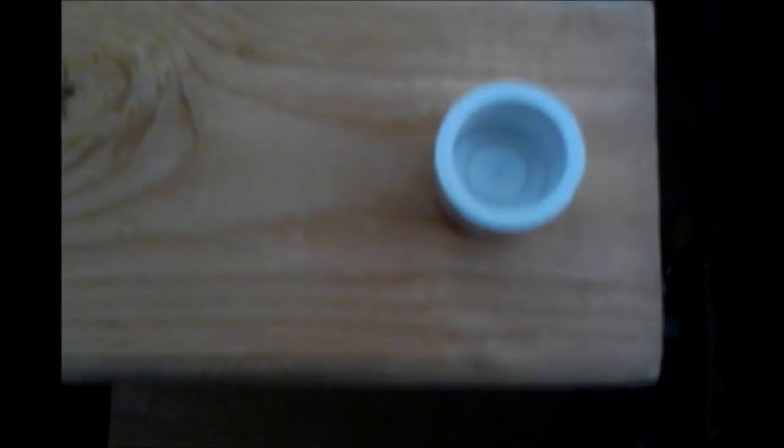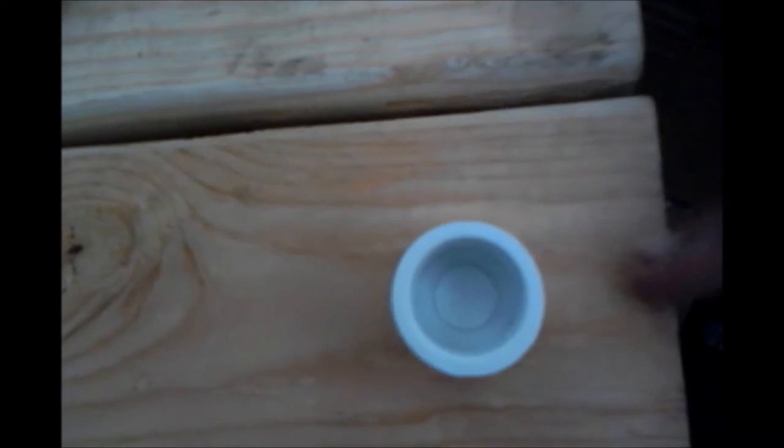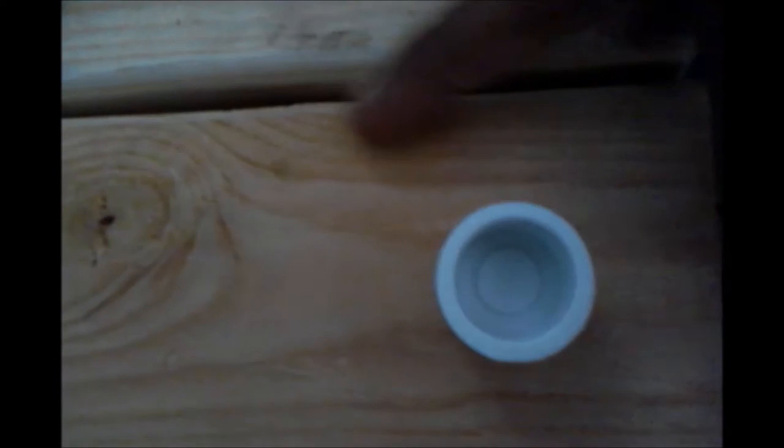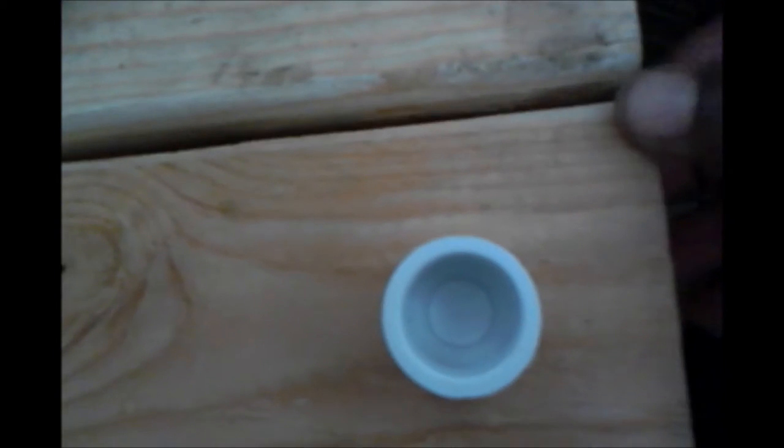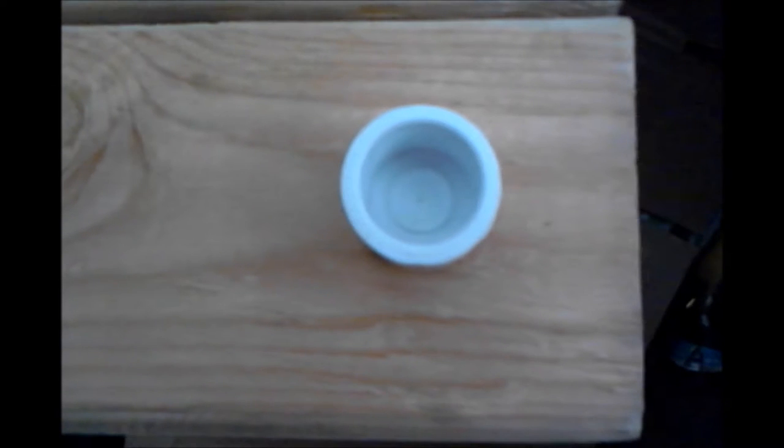What you need is a PVC cap. The pin is about half inch thick so it fits right into this PVC cap, and that's what we want. You're gonna cut these corners so that they're rounded, so that when you open the door it doesn't catch on the corner. Make sure to cut just enough because you don't want it to swing too loosely, but you don't want it to not be able to swing at all.